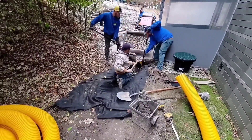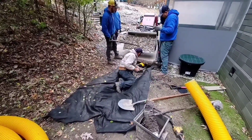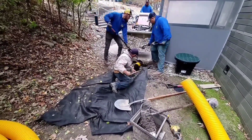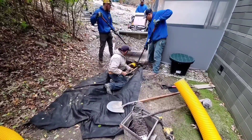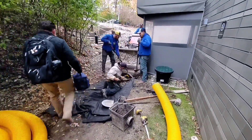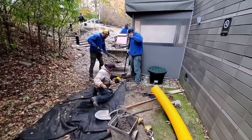You can see the old 12x12 basin. We removed that along with the 4-inch pipe — it wasn't doing the job. We could have run two 4-inch pipes and that probably would have been the fix, but we have a 20-inch round basin that takes a 6-inch pipe, and I really wanted to use that on this job.